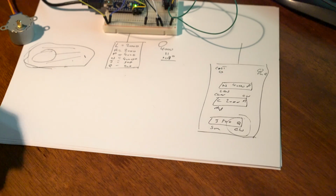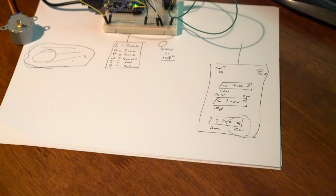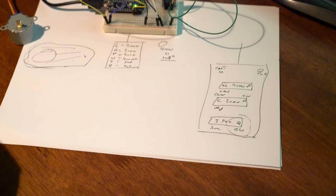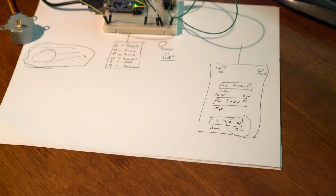And I'm sure the machine, because I'm not working at the moment, I'm kind of on a budget, I've ordered a lot of bits that, if I was working, I would have just got the best bit. But now I've kind of justified the parts, like some of the stepper drivers. I've looked at the specs, and it says it does like 3.5 amps, and the motors are 2.5 amps. So I'm going to go with the cheap ones, rather than things that cost 10 times as much. And also, I really fancied servo motors, and I'm going for the stepper motors. Anyway, whole new can of worms.